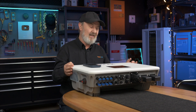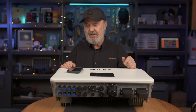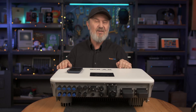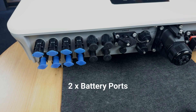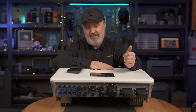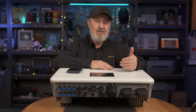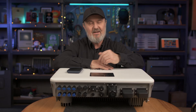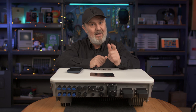Speaking of batteries, their batteries actually have an aerosol fire suppressant built in — extra safety is really good. Lastly, in terms of standout features, there's V2X coming soon. One of the battery ports can be used as a vehicle connection at DC. You connect the DC port on your vehicle using the standard vehicle connector, and it will use the battery in your vehicle to power the inverter. Since the inverter can power your home — in backup as well as on-grid — it can do vehicle to grid, vehicle to home, or vehicle to load when the grid is down. V2X means everything, and that's coming soon. Those two battery ports are pretty clever — they can be a battery port or V2X.